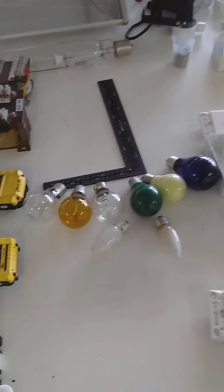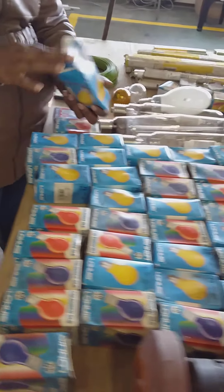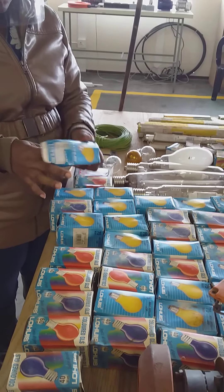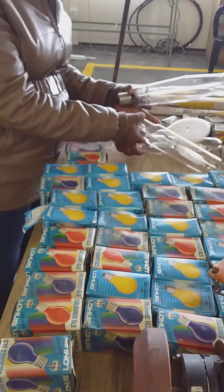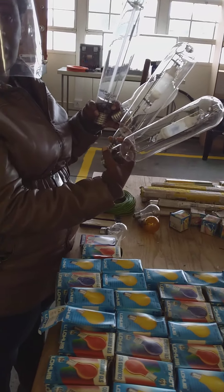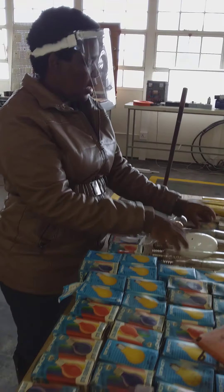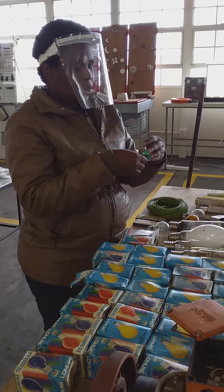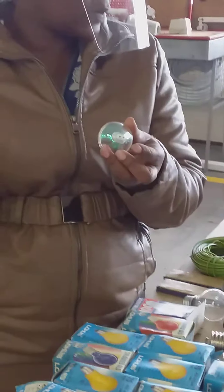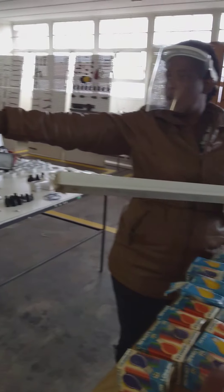While still on lighting systems, you can see I've got a collection of all lights — some are purple, some are yellow — but the important thing is that they are Edison screw. For different lighting systems, that is street lighting and also for aesthetics in places of leisure, we've got different types of voltages too, and also our LED downlights. You can see this one is pin-type; they'll be having different types of sockets. And we've got mini fluorescent, which will be used on full house wiring.